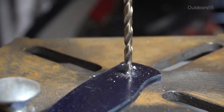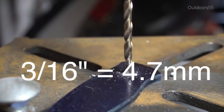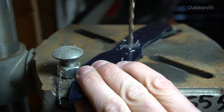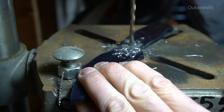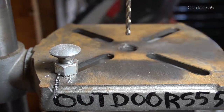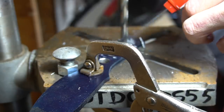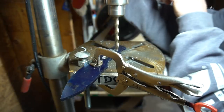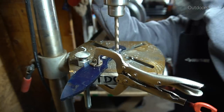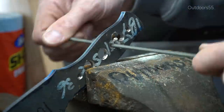So let's talk about drilling a bunch of holes in the tang of this knife. This knife is 3/16ths of an inch thick and I'm going to be putting a full flat grind on this knife, which means I need to lighten the tang as much as possible in order to give this knife good balance. Now about drilling — I get comments all the time from people saying to slow my drill press down. This is as slow as it goes. I wish it did go a lot slower because it would give me more torque to get through the stock. I do have a more powerful drill press but the chuck on it is broken and I need to get a new one. So here I'm just filing out some of those center holes that I drilled just to try and lighten the blade as much as possible.